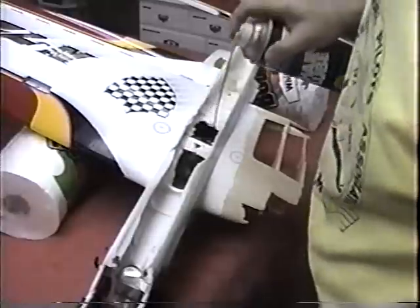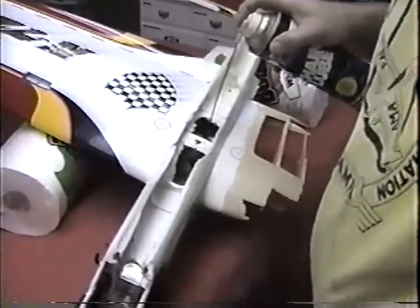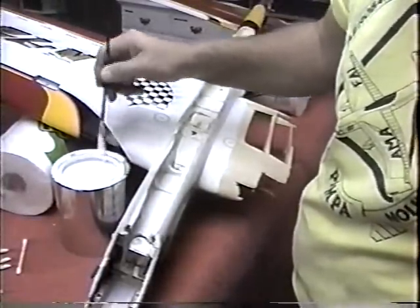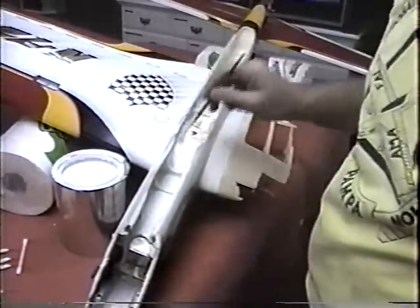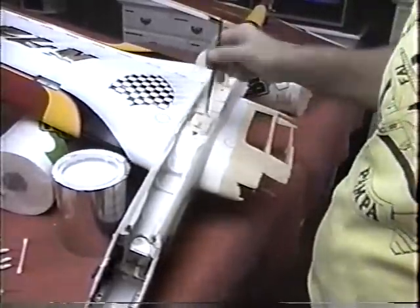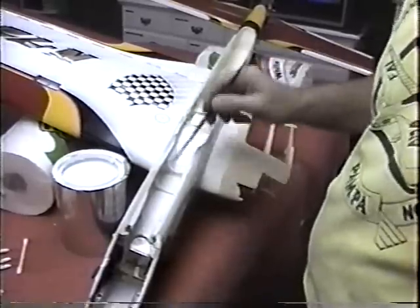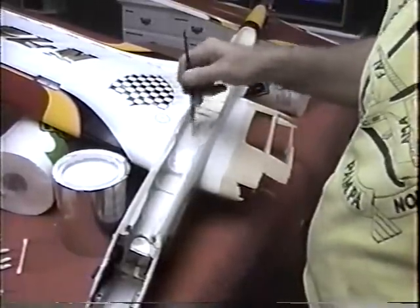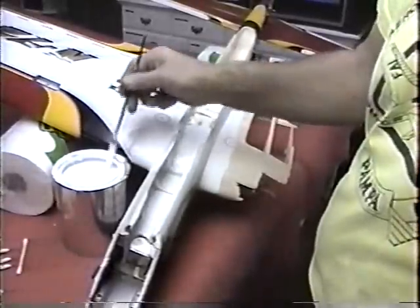Now the next step is going to be to seal this up. Now, I decided not to fiberglass this. That was plenty strong when I put the CA on it. Famous last words. What I want to do is just get this fuel-proofed for right now. This is just cosmetic. Keep the fuel from soaking in there. Another good test for Brodak dope, which seems to be holding up way above our wildest expectations. All this is just to get it fuel-proof for now.